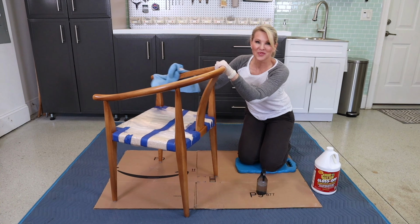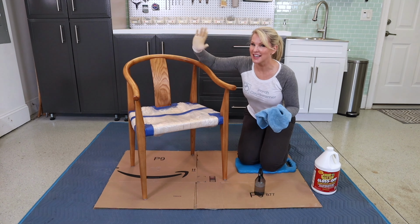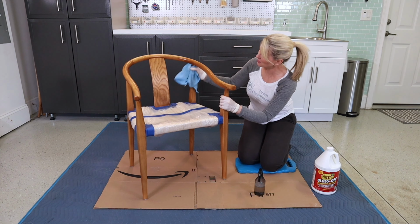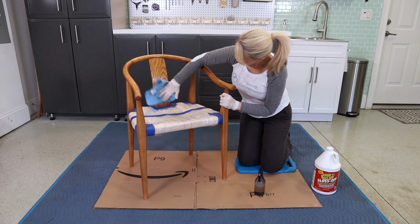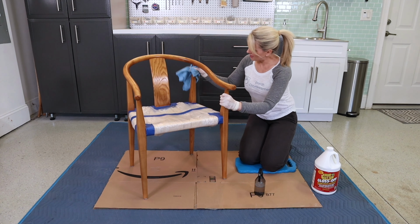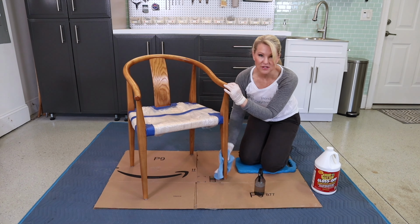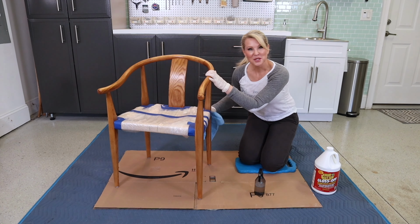And what's kind of cool, this is the last thing that we're doing on day one. Some of the stain is actually coming off on this glove as I'm rubbing this. So that means that this really isn't a very sound finish, and so it's good that I'm doing the Gloss Off. Once this Gloss Off dries, so you can see it's kind of wet right now, as it dries, you can see that finish get a little duller and tackier. And that's what we want.